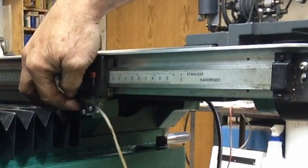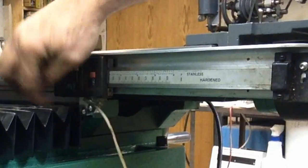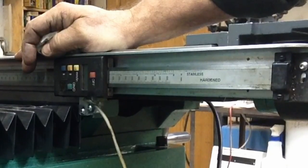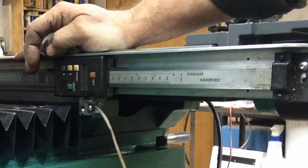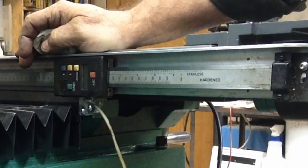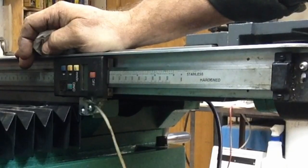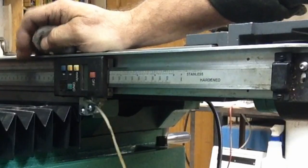Now we've got a clamp around it, and it's clamped into the bracket. And then we've drilled and tapped the lower part of the bracket back into the end of the Y-axis casting. And it's just a 10-24. Tapped in there, make sure you get your alignment right and everything. I've already had it hooked up to the scale, to the reader head, and it's spot on. It matches up with the hand wheels, and I'm really happy with that mounting.